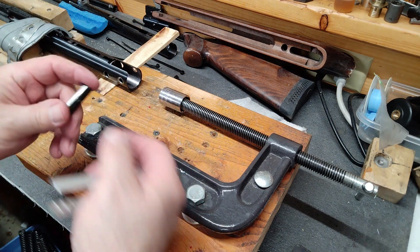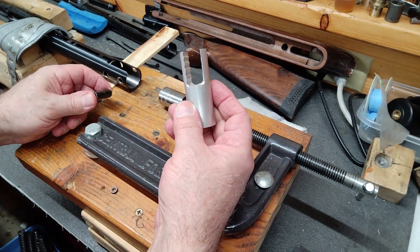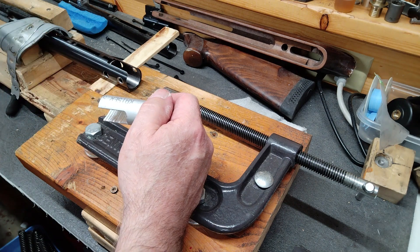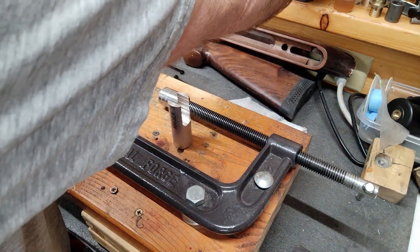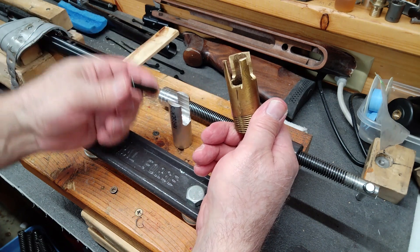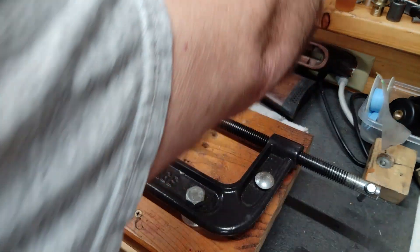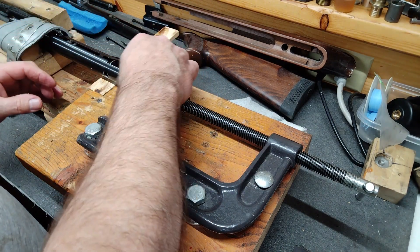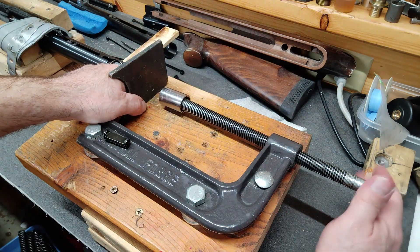Some of you may not know how to get the gas ram pushed back. It's simple — you just make a little tool like this, made out of aluminum. It gets past the bar, pushes into the gas ram to give it some preload, and then you can install your pin. If you don't have aluminum, go to Home Depot and get a three-quarter inch brass nipple — use your grinder with a cutoff wheel, do your notching, and it works the same way.